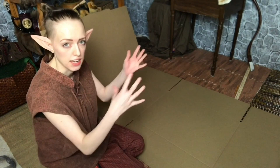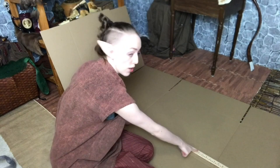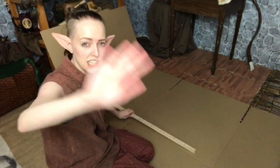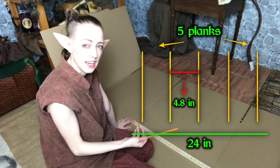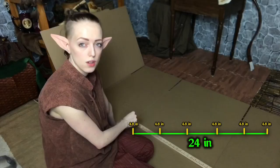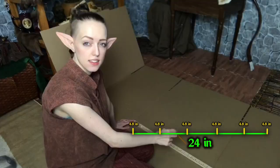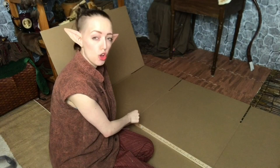Now you're going to want to basically measure the distance between each panel. The bigger section is 24 inches, and the section that is smaller is 18 inches. So let's say I want five wooden planks in the bigger section — I'm going to divide 24 by five, which gives me about 4.8. Same thing for the section that's 18 inches — divide that by four because it's a little bit smaller, so that would be about 4.5. So on the bigger panel I'm going to mark 4.8 all the way across, and when I get to the smaller section I'm going to mark it 4.5. Those will be slightly thinner wood planks, but as long as your wood planks look mostly even, it should be fine.